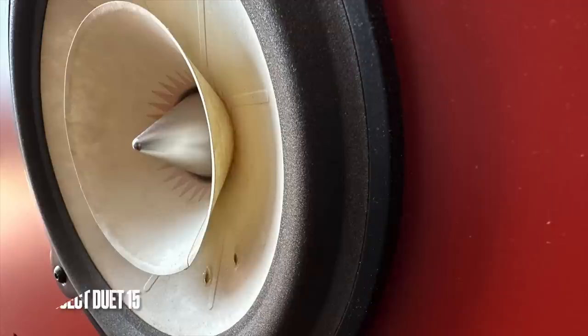One other thing about the sound that struck me after a few days of living with the Meitner pre is how quiet it was. The absence is not the thing that jumps out at first, but yes — how quiet it was. Even when I switched inputs or went in and out of mute, no pops, no noise, no nothing, just really, really quiet. Even when I put my ear right up to the speakers — this thing does not make any sound of its own. Very, very impressive. Part of the reason this is so is because the switching is all, as Ed describes it, contactless. There's no mechanical switches or relays or anything. All the switching is electronic, and the signal path is 100% analog.